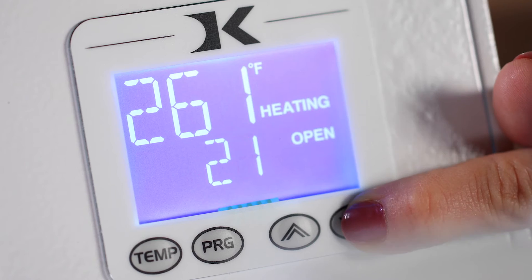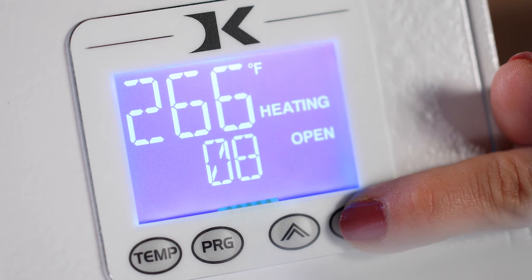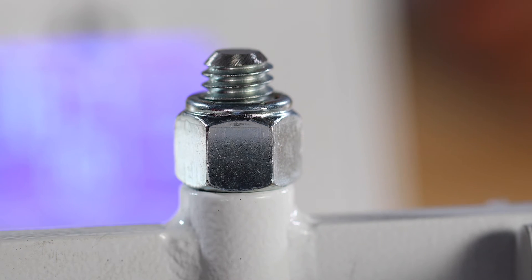Now set the time by using the arrow keys. Again, if using tags from Cleaner Supply, we recommend a dwell time of 8 seconds. The pressure is preset on the hot seal machines. However, if you ever need to adjust it in the future, you can do this by removing the protective cover and adjusting the bolt on the top.